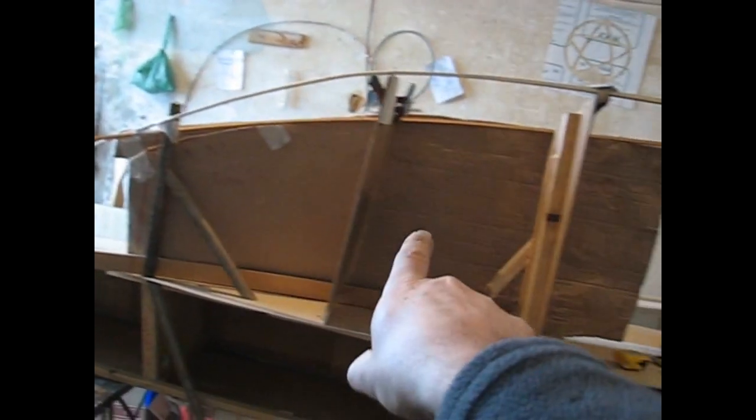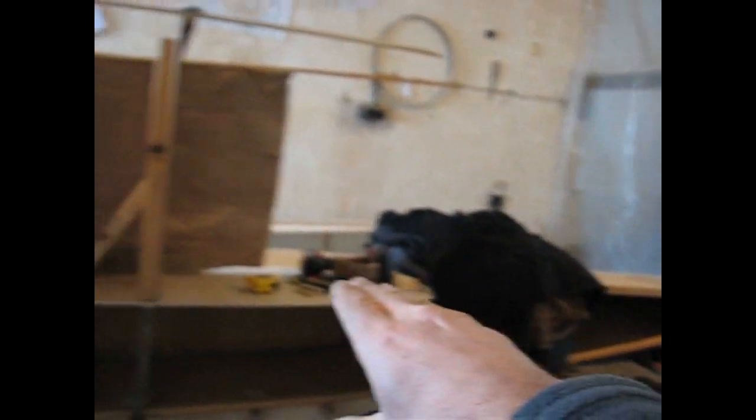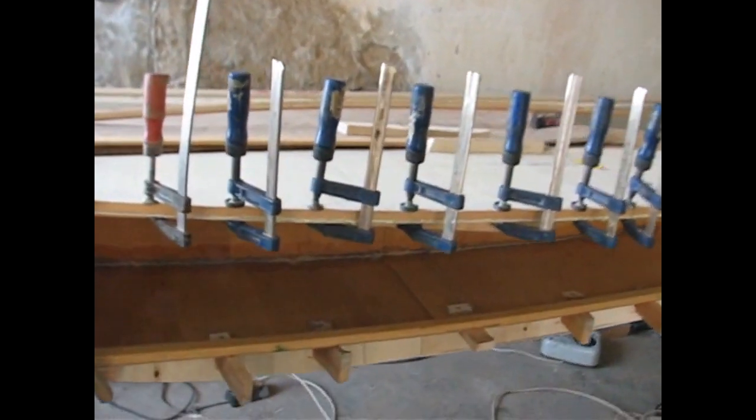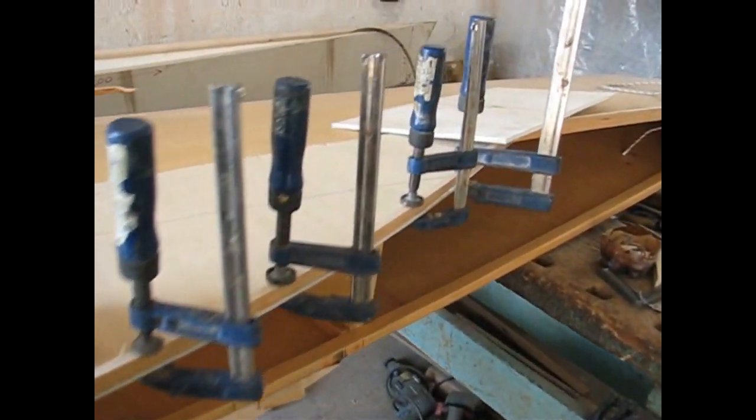I leave my ply slightly running wild over here and slightly over there. I'm using a template to roughly get the size of ply I need and to get that cut. Afterwards I throw away the template and leave about one or two centimeters extra everywhere. Then once the side comes on, everything will come into place. If floppy plywood is playing tricks on you, don't ever hesitate to just put a batten on it and finish.